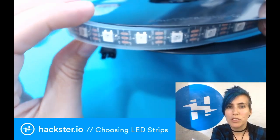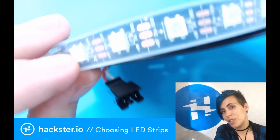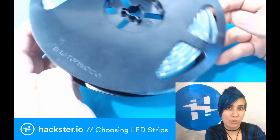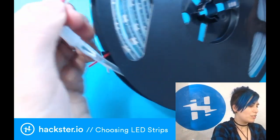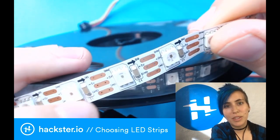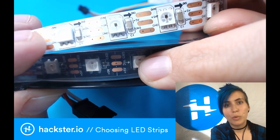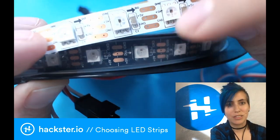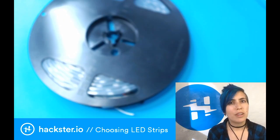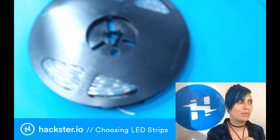These kind of smell, by the way. The waterproof version just comes in a silicone tube sleeve, so it's a little harder to attach to stuff, but zip ties or electrical tape will do just fine. NeoPixels do not come with a remote control, but you can make your own with Arduino. You have to have a controller to run them, because they have only three pins: 5 volts, data, and ground. Again, make sure the pins are going in the same order — for example, here I have data, 5 volts, and ground on one, and ground, data, and 5 volts on another, so they're totally different. You also have to pay attention to which end of the strip you're controlling — it has an arrow on there for a reason. I've heard that little clamp connectors meant to attach LED strips without soldering came apart pretty quickly and weren't very durable.